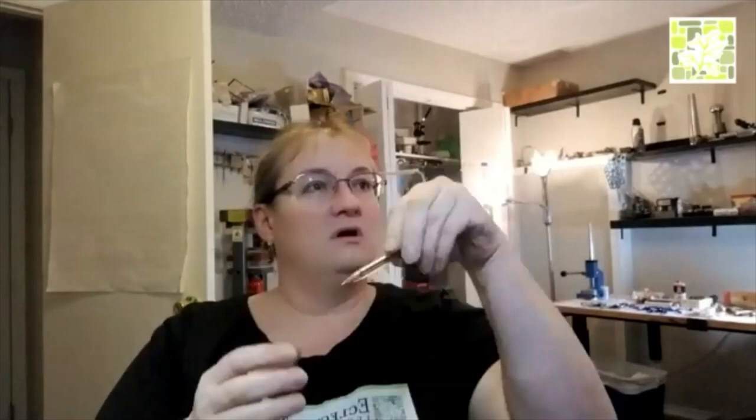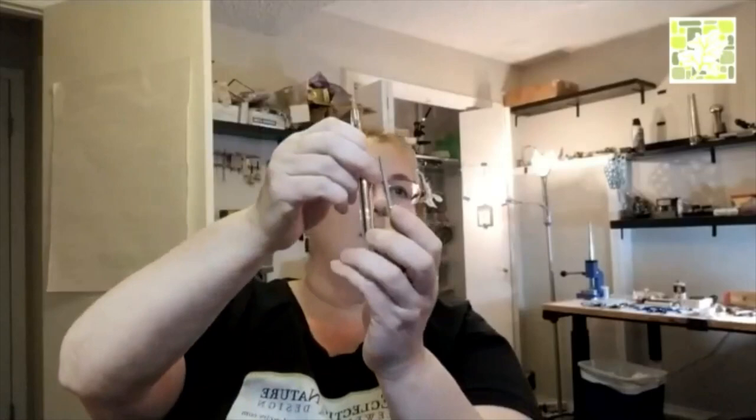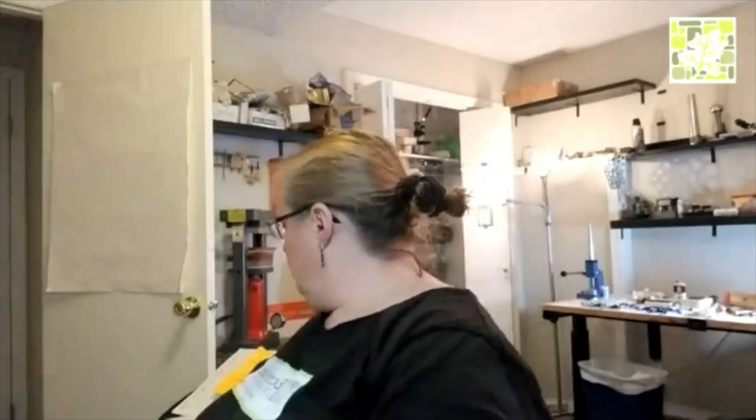But again, just put a pencil or something in the squishy part where your palm hits. Hold on to where it pinches, where you've got it held. That's the max length that you want by the time you're done, so that the total length, once it's in a handle, should be the length that you've got there. Hopefully that gives you enough to get a sense. I think he's written that up in chapter 5, the sizing part, at least for the gravers, for when we get to that stage and we're creating all of our handled gravers. Questions?